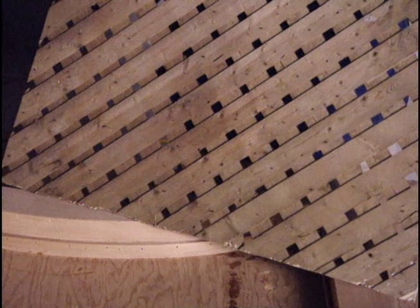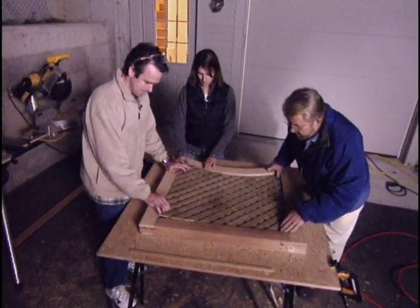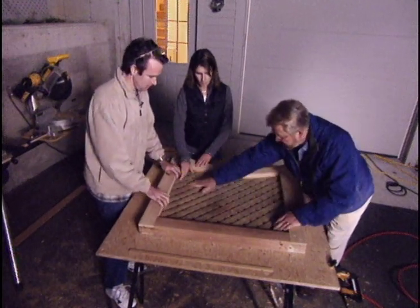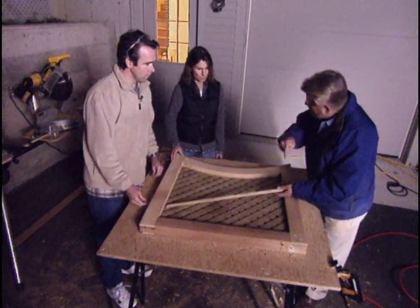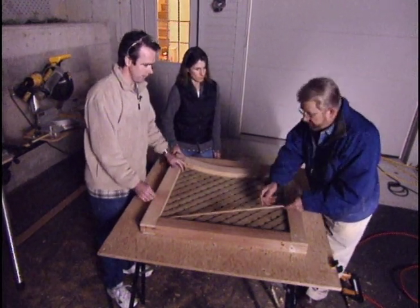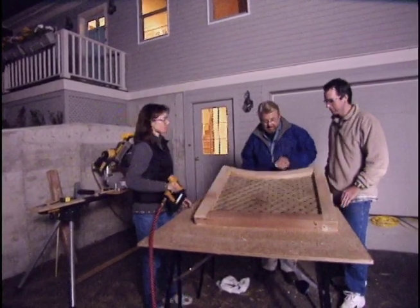After cutting out a piece of lattice work to fit the frame, we drop it into place against the keeper strips. There we go. All right. That looks nice. Now we'll take some more of these keeper strips and put them on this side, the same way we did the back side. Right. All righty. We got a gate.